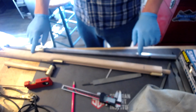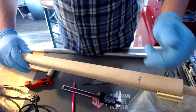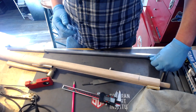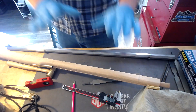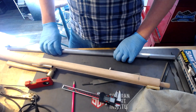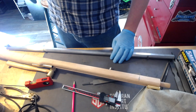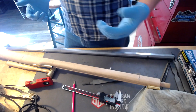Now what I've done is — since I've got that bottom line — I measured to the bottom of the tenon line here and then went half the distance back up. I figured out what the distance of the tenon was, halved that, and that's my mark. So now hopefully this works. We're going to try it on the back one first — drill through until I hit metal, pull it back out, see where it lands, and go from there. Wish me luck.